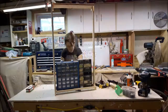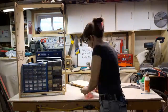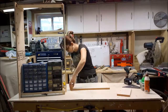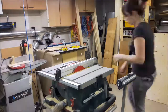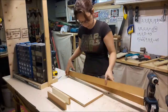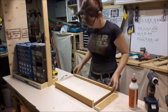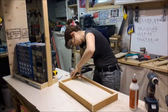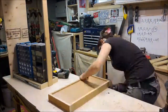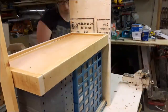And now for the really fun bit — I can start putting in the shelves. I pretty much just made the shelves the same way as I did the base, making them out of whatever material was left over, even leftover from the cabinets that were there. Cutting out a base, cutting out some cleats to go around it, and then just tacking them all together, gluing them up, putting them in place, and just kept stacking until I ran out of space in the drawer. The one thing I did do differently is I made these wider. Because at the bottom with the cleats the drawer is actually a bit skinnier, so I was able to add about 2 inches as soon as I got past that first shelf.